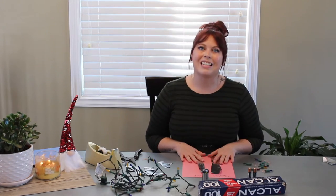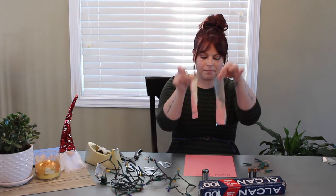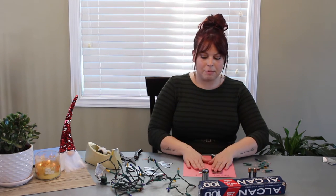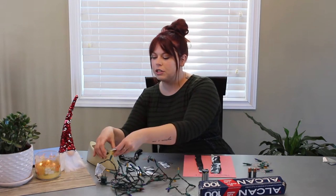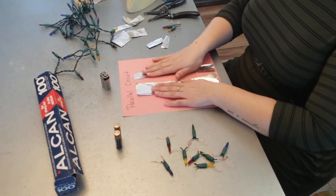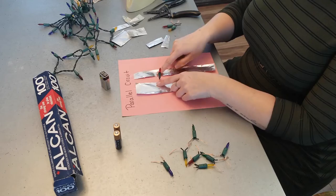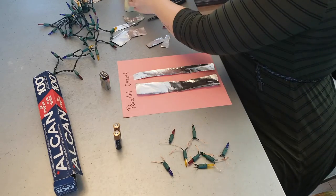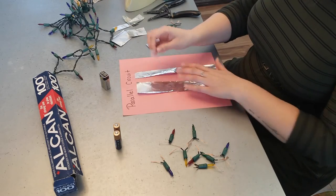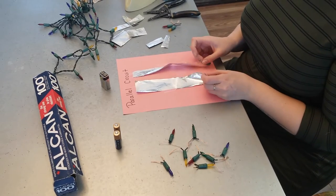Let's get into it and I'll show you how to make your very own circuits — starting with the parallel circuit. For this, you are going to need just a piece of paper and two pieces of tinfoil cut into strips. Make sure they fit on your paper because we are going to tape them down. Using a little tape, just tape the top, and make sure you tape them so that you have enough room for your wire to touch both of them — if they're too far apart, it won't work. Leave the ends free so you can touch the batteries at the bottom.